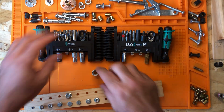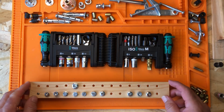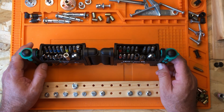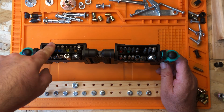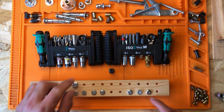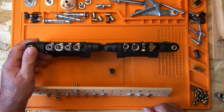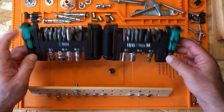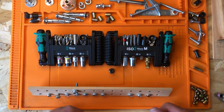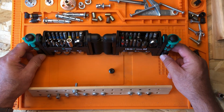But really the main question I have for you guys is, how many other fasteners need identical or similar drives on both sides, on the top and the bottom, on the screw and the nut? I think I might have taken care of all of them. I've got the M4 hex internal Allen key for Chicago screws, and now I have 2 sockets of 8mm and 10mm for regular hex nuts and bolts, and I think I can find some 12-point M6 bolts. What do you say? What am I missing? What else do I need to be able to attach the bottom and top fasteners for an M6 fastener? Screw, bolt, nut, captive nut, etc. I think I've got it covered, but I'm not really sure, so I'm looking for advice.